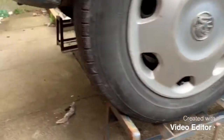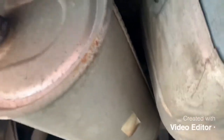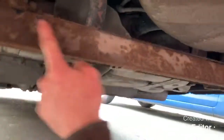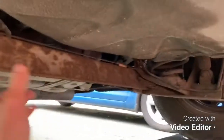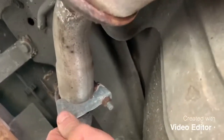Once you've got the car up and off the ground, head underneath. This bit sticking out the back is your exhaust, and this is the rear box or rear silencer. Get right underneath where the big back girder is across the back and you'll see a clamp somewhere around this area - there'll be a bit of pipe coming off the back of the box and at some point it should split with a clamp. It might be a different style clamp, but there'll be a clamp of some sort.